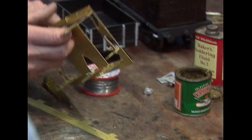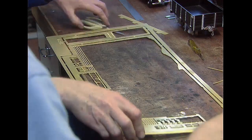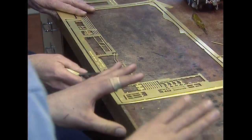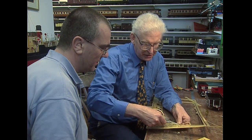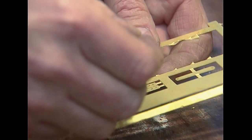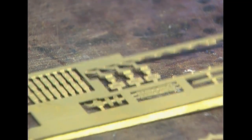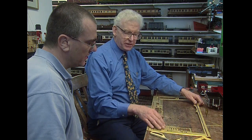Can we see a bit of soldering? Yes, I should think so. I've already done quite a lot of work on this particular wagon. This is brass, isn't it? This is brass. And what I was proposing to show you was these little things here — they go like that and like that. This is part of a kit for a gauge 3 wagon. It's been what we call chemically milled — it's a photo etching process, and all the parts come in sheet form like this. You just take them out, bend them, solder them up and you end up with the wagon.